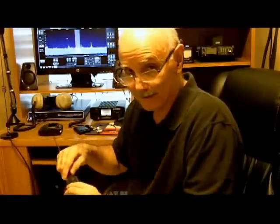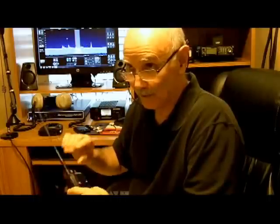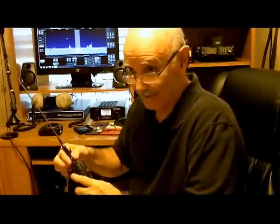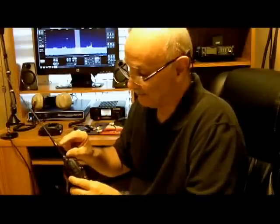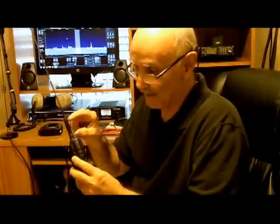It may not be something you need. The antenna that comes with it is certainly good enough as long as you're not far away from the repeaters. They do not put what we call a rubber ducky antenna — a little bitty one about that big — on this radio. That antenna definitely needs to be replaced with something else because it doesn't have much gain. If you see one of those, you need to go get a little bit better antenna.